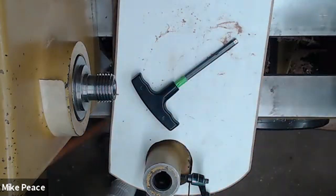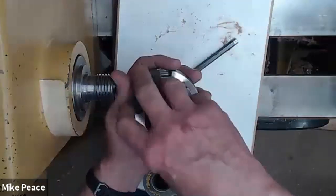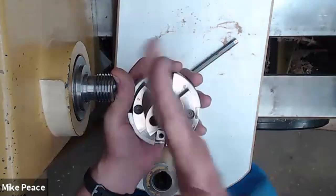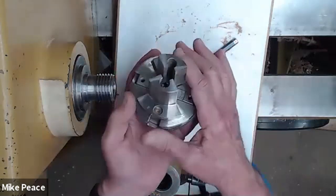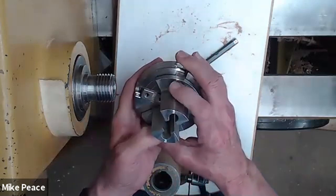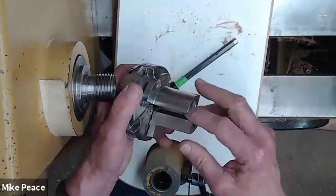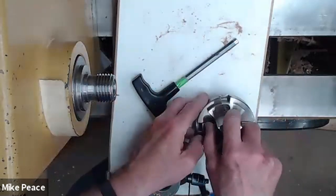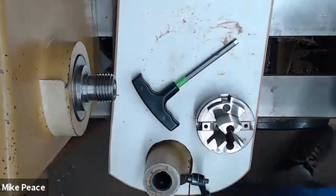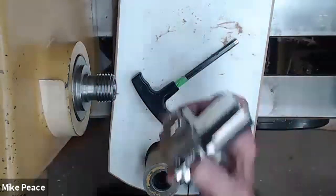Nova has 35 millimeter spigot jaws, but they don't operate the same way. And you have the pen jaws, which to me is a great deal for the manufacturer. The jaws are made out of a big block of steel, and then they cut them. So in this case, they cut them and get to sell one pair to one guy and the other pair to another guy, and still charge you like they were giving you 4 sets of jaws. But this is great for drilling pen blanks. I also use it a lot for drilling when I'm doing fan pulls. It works great for that.